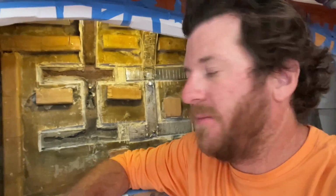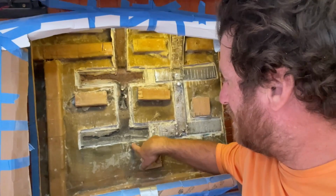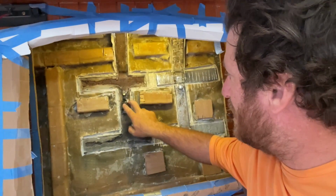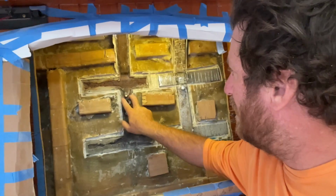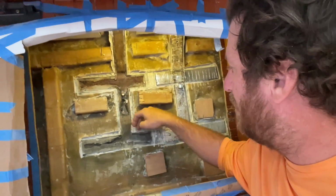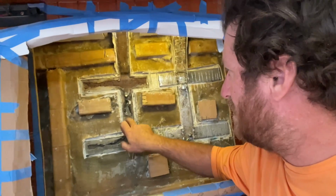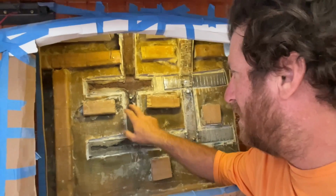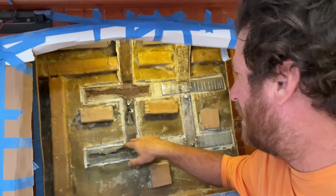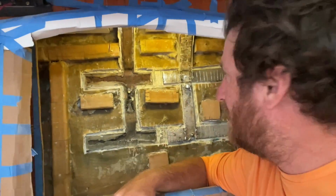So tomorrow he's going to come in and extend this area because the chain plate's going to come down a little bit more. The new chain plates, and remove this stud. The new chain plate's going to sit right in this little valley. They're going to grind all this down, and we're not going to fill any of this back up because this is the hull, and it's just going to live right where it used to live. We'll see when he fills all this stuff back up if I want to take this off and just fill this just for prettiness sake.